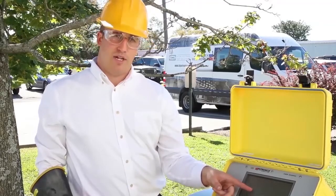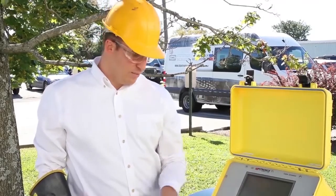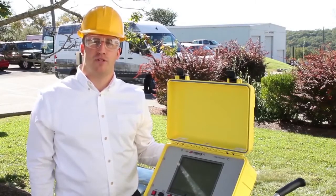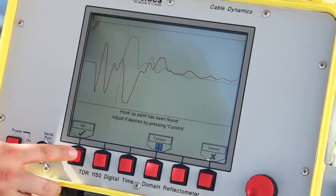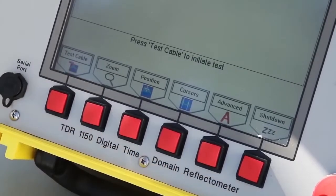The intersection at that point is where the hookup point will be located. If satisfied, you can press OK. Once the hookup point has been saved, it will not have to be set up again unless the operator adjusts the start cursor during the cable fault locating test sequence. Now we're ready to start the test sequence, so let's hit Main Menu to get back to the basic mode menu, select Basic Mode, and now we're back at the basic mode main menu.